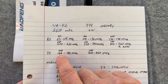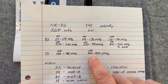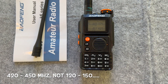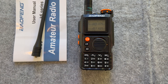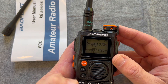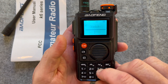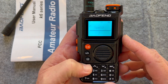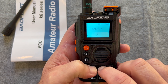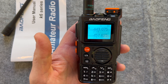On transmit, you've got VHF — the two meter, which is 144 to 148 — and the 70 centimeter, which is 420 to 450. So those are the frequency specs. Going to menu 23, that should be squelch. Hit the menu button and you can see I've got that at two. I'll leave it at two. So that's pretty much the same operation as before — that works.